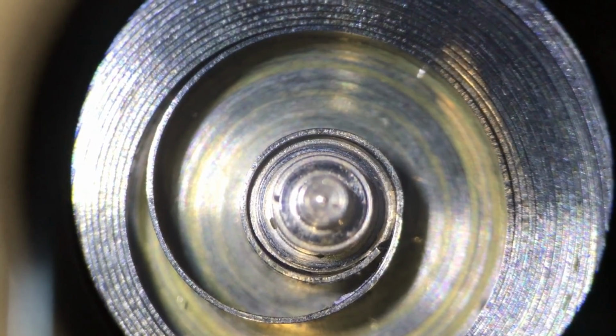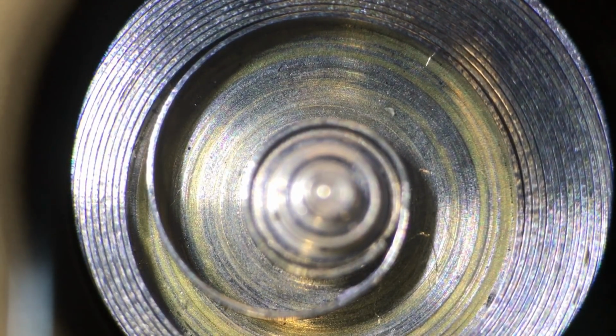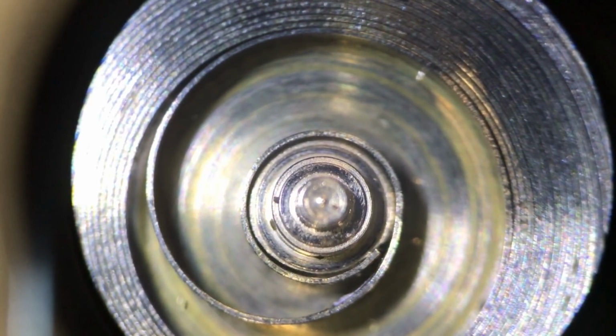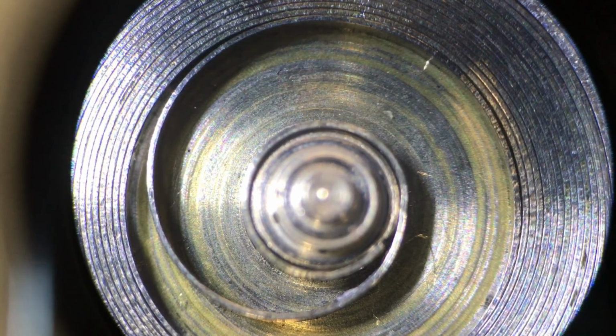Now there is a bit of wear to the barrel itself at the bottom, as you can see, but that's quite typical. It looks bad, but it isn't really too far worn into the metal, so I'm going to test it, put the lid on, and when we build the movement we'll put it in and hopefully it'll run. If we get some anomalies, then of course I will change this, but in my eyes so far I don't think it's too bad given its age. It's just really unfortunate that you didn't catch me winding it in for you.